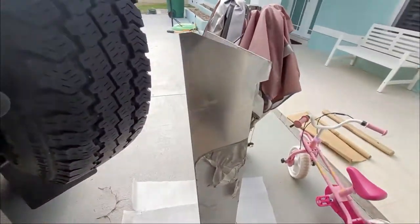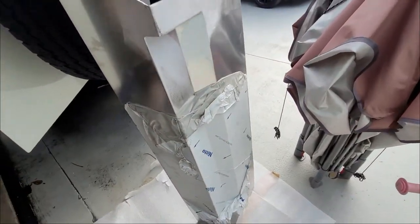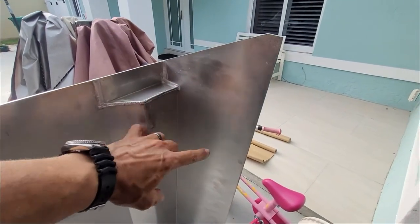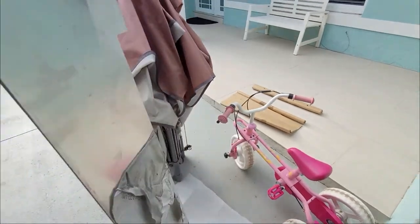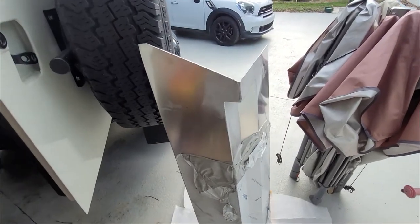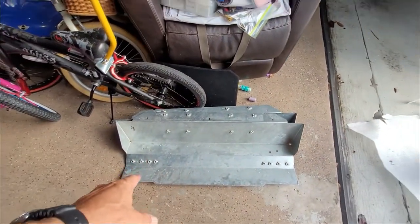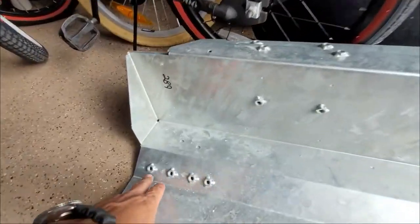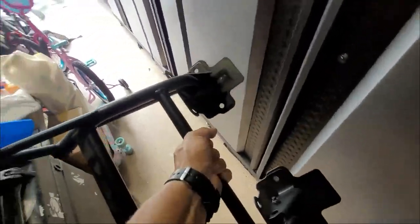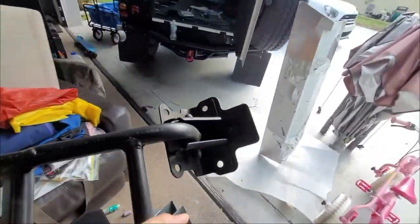Here's the raw plate sitting out. The one used in the YRM workshop already has the holes that match up with the underside support and the holes where the brackets go — this one does not. This might have been an earlier or later version from someone in the states who had bought the system and decided not to do the conversion. I will have to install these pieces underneath, and these have the nuts welded in a particular spot that will match with these, so I can't just make the holes anywhere.